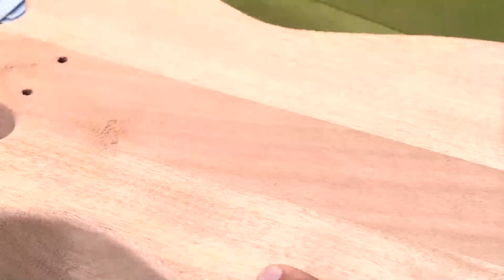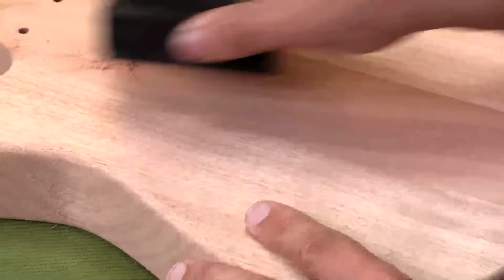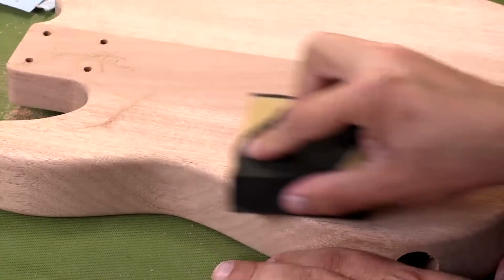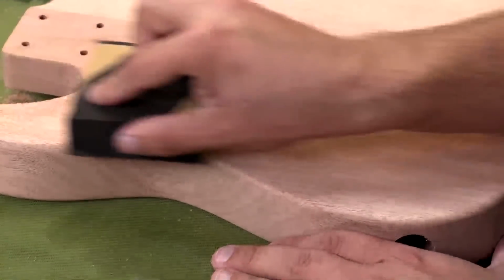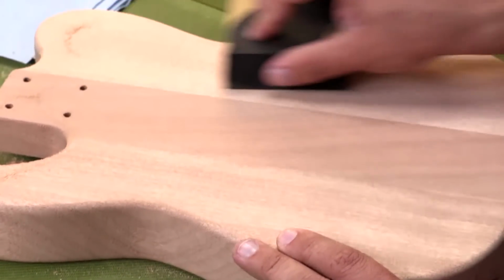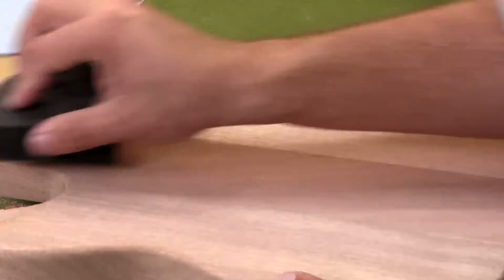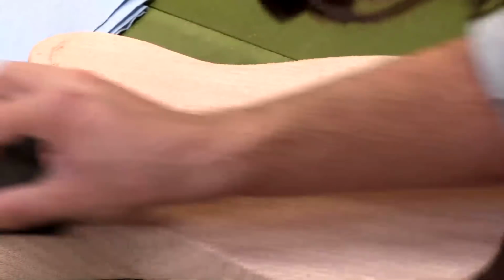Yeah, absolutely. And something that Blake was saying earlier, I'm not sure if everyone was here or if you may have missed it the first time around. When he's following the grain lines with the sandpaper, he's basically hiding the scratches. When we're sanding, we're making the bigger scratches smaller scratches. And when you sand with the grain lines, it's much easier to hide those smaller scratches. They basically will look just like the grain. You won't be seeing any lateral or perpendicular scratches, if you will.